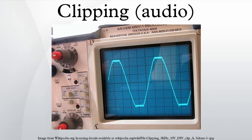For instance, if a circuit has 10 decibels of applied gain, it can be tested for clipping by attenuating the output signal's gain by 10 decibels and comparing it to the input signal. If the circuit is driven into clipping, the attenuated output signal will show less voltage in the comparison. The electrical offset between the two signals can be used to illuminate clipping detection indicators, such as a red LED, and can be used to decrease the gain of a preceding circuit so that the level of clipping distortion can be limited. See also: clipper, clipping, distortion, dynamic range compression, loudness war, tube sound.